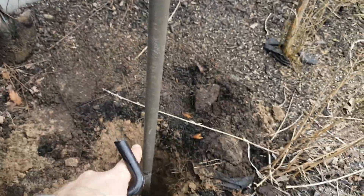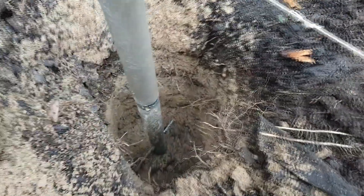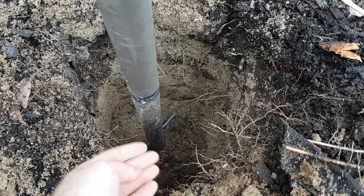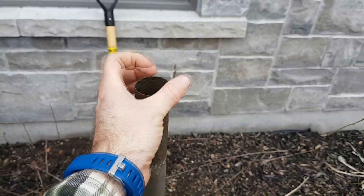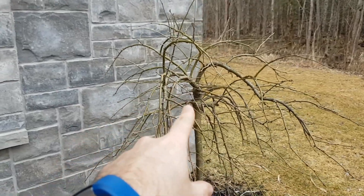You guys know the saying — if you're not handsome, you better be handy. I'm not sure the wife's gonna approve of this, but here's what we're doing: a hybrid solution. I've taken one of these poles from the old bird feeder, sunk it three feet into the ground, took the grinder and cut it in half, and put a bar through it. We're gonna fill that with cement so the cement has something to latch on to and you can't lift it out. Then we take that little flimsy rod, put it inside here, center it with a washer, and fill this with cement. The hanger will be right here in front of my little tree — you guys have seen the hundreds of bird shots that all come from this tree.